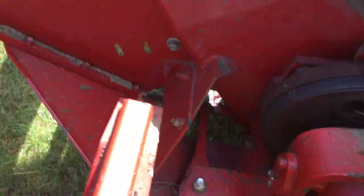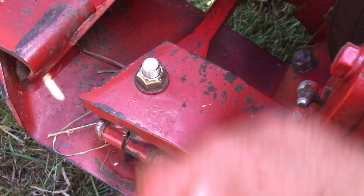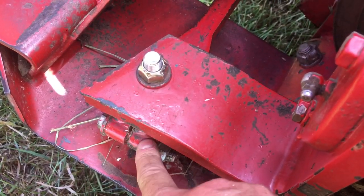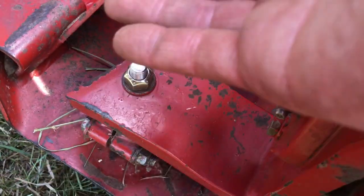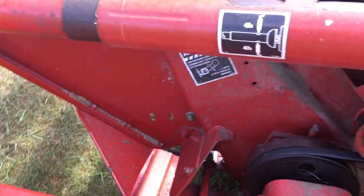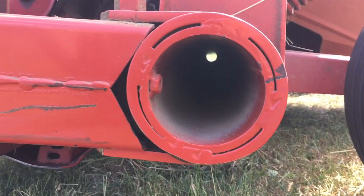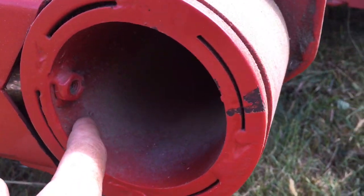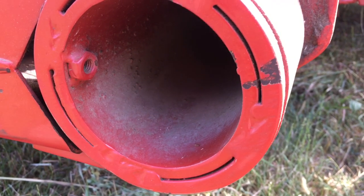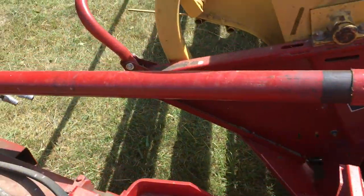Come over here to your knife head — that's the knife head right there. This big bolt: you just take that nut off and drop it down from below. This is your knife head bushing — you just grab the whole knife head and it will just pull out very slowly. By the way, this big long tube is storage for an extra knife, and this nut right here — you can screw a 5/16-18 bolt into there and actually bolt your knife in for storage.